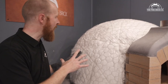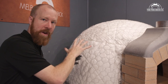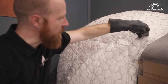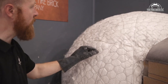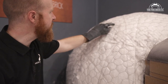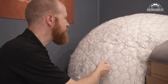Chicken wire is on, and I just want to show you a little technique for pulling it down against the blanket, because when you put it on it'll be all bunched up and pushing out away from the blanket. We really want to pull it in nice and tight. Rather than pushing it down — which just springs back up — if you pinch nearby you can actually pull it and it'll pull itself down. That's a great technique for any areas sitting a little higher: just pinch and pull those wires together. It doesn't have to be sitting really hard against the blanket everywhere, since we're putting two inches of perlite render over this.